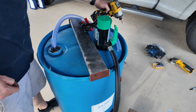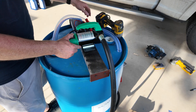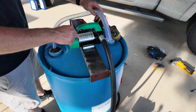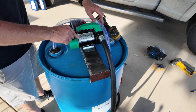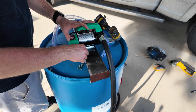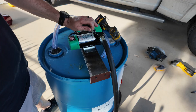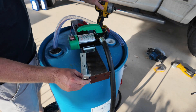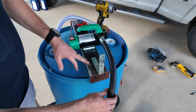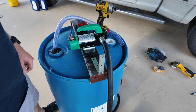I brought the pump up and tied it down with set screws. Placement-wise this looks good based on how the hose is laying. I'll cut the tube a little shorter once the RTV sealant is fully dry, then it'll line up perfectly on the nipple. I got some backer board screws to secure it all in. The last piece is an oversized L-bracket screwed to the wood — I'll grind down the edges so they don't punch a hole in the hose — to wrap the hose and hang the fill nozzle up off the ground.